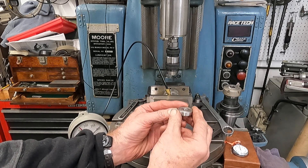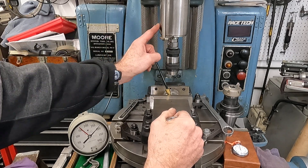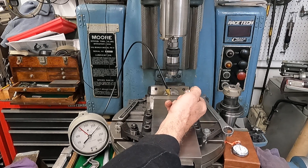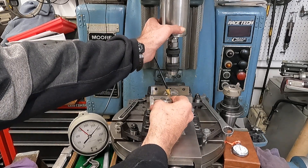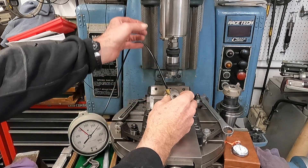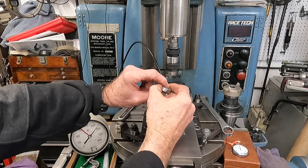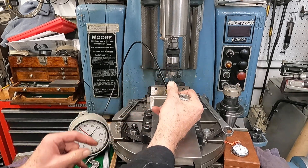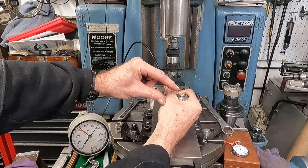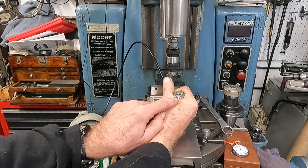You will make holders, because you'll have this spindle apart. You'll take your dial bore gauge and measure what the bore is where these bearings go in. You're going to have to recreate the way these bearings nest, and you're going to have to make a plug that's a duplicate of the spindle journal that goes through the center. With the plug and a holder, you'll use this scale on an arbor press, press on that inner race, and have a dial indicator arranged to measure the deflection — each bearing. There's no other way.